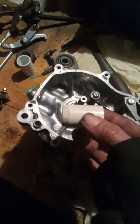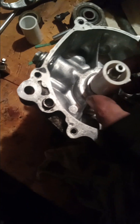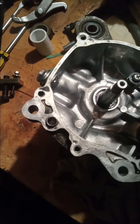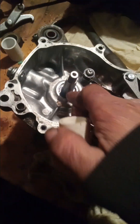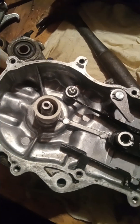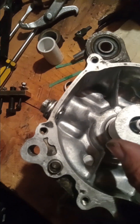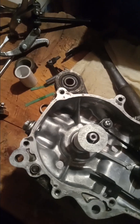What I did was cut a piece of three-quarter inch PVC pipe. It fits the right height because I cut it down, but it didn't fit the diameter of the hole, so I beveled the edges on my bench grinder and it fits just perfect, right where it's supposed to fit squarely.